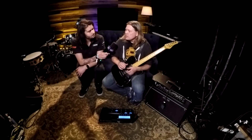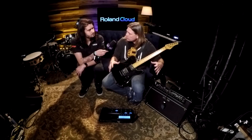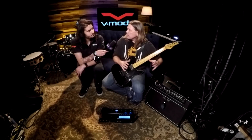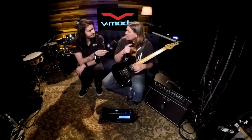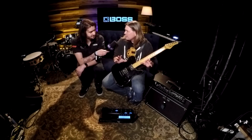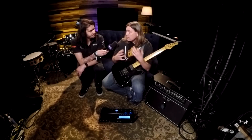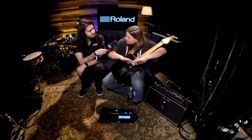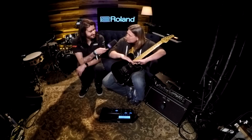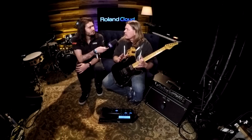The way we did it is we started by looking at the Waza amplifier — the big touring-class head that we sell. The speakers that were made for it, we had to do a custom design. We wanted to do greenbacks, but because of the 150-watt power, we couldn't. So we had to design a hundred-watt version of the greenback speaker. We went through an exhaustive study for like two years, going through everything — figuring out exactly how much hemp and corn and everything is in the paper, looking at old rolled and folded paper cone versions as opposed to pressed quantity cones. The engineers at BOSS really figured it out and got a great speaker.